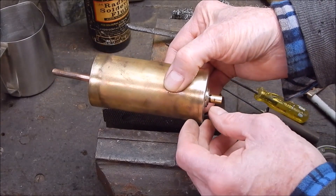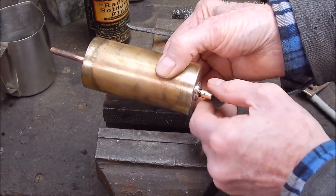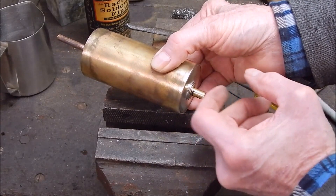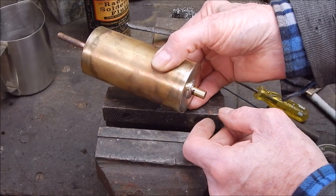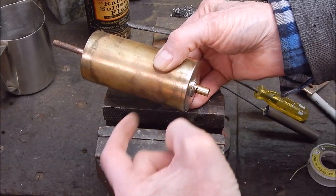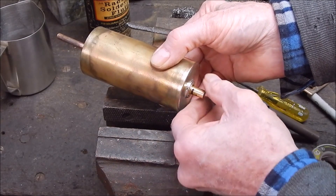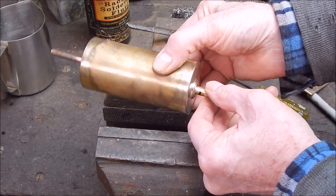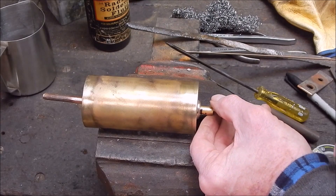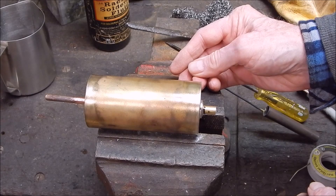The whole thing will basically be on a couple of supports right through, with the valve hanging out here. 20mm stroke. There's a small flywheel — like a crank wheel — and then you have a bigger wheel out here for your main anti-vibration, inertia function. And then a filler in the top and a vent, a blow-off valve as well, which I've got one somewhere lying around. So yeah, moving on.